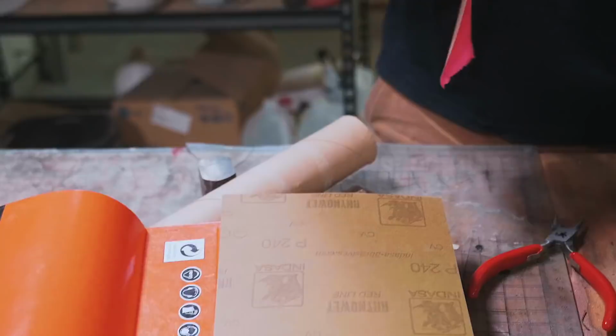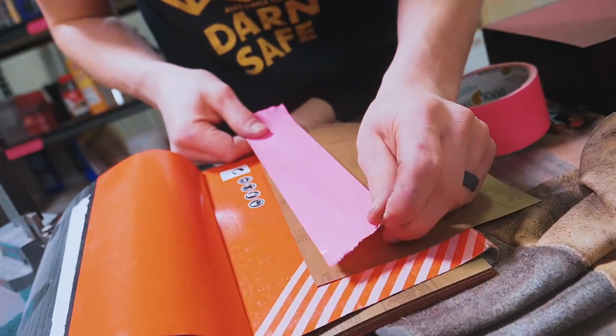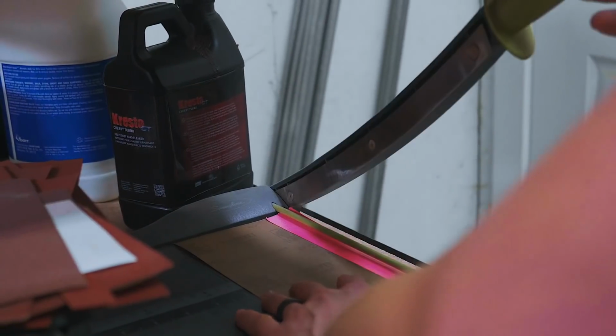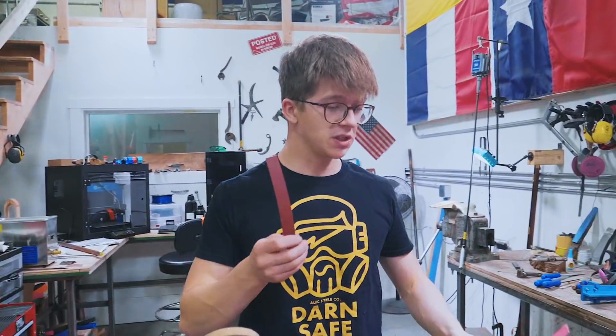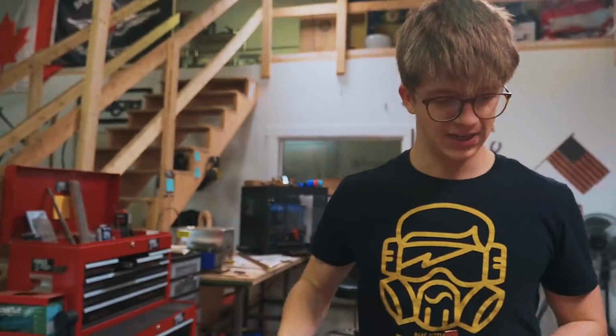trick. What I'm doing is I'm shoe shining the steel. Take some duct tape. Now listen guys, it absolutely has to be pink duct tape though. No other colors of duct tape will work. You put it on the backing, and then you gotta cut it off in your paper cutter. What this does is it gives you the tensile strength of duct tape while still having a very nice flexible piece of hand sanding paper.